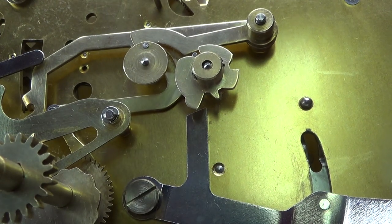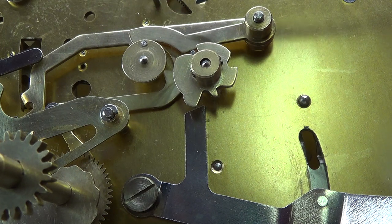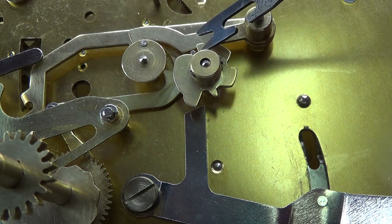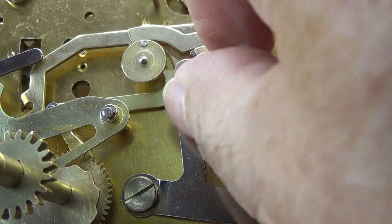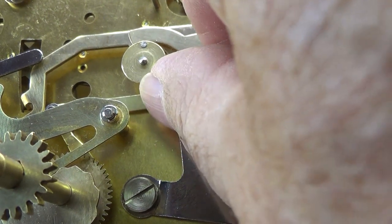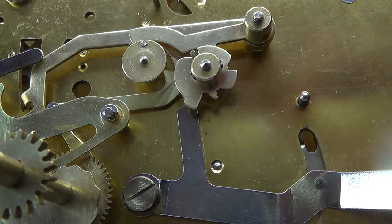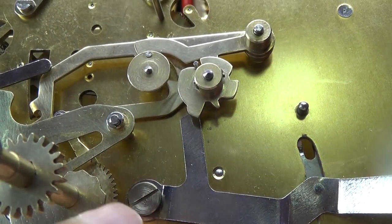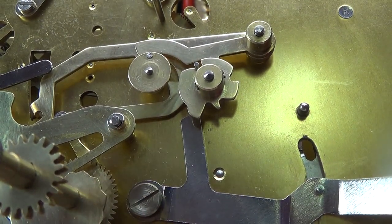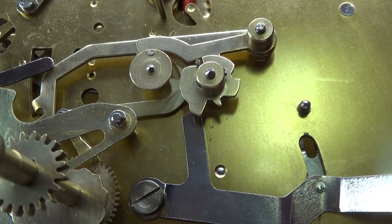So to set this up, you put this one on, put this on, tighten this, then put this one on, and set it so that it's at the three-quarter hour. So this is all locked. From there on, don't worry about anything. It'll correct itself no matter what this is, whether it's on a quarter hour, three-quarter hour, half hour, whatever. It'll correct itself at the hour.